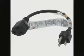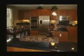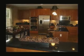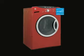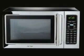Grounding on a cord — you have a three-prong grounding. Do not remove that grounding prong. It's for grounding your equipment, your tools, your power tools, your radio, or whatever you're using. For instance, your appliances need to be grounded. They need to have that three-prong receptacle — it'll protect your appliance.